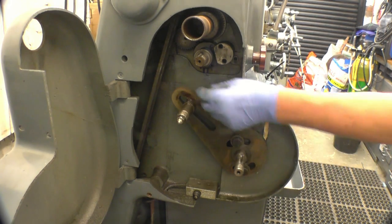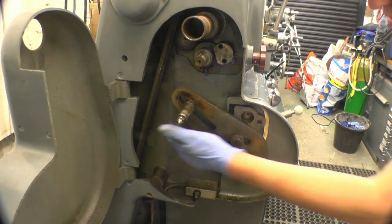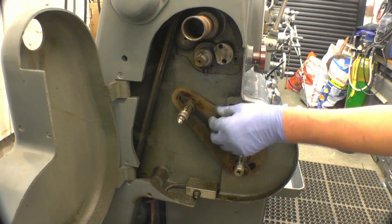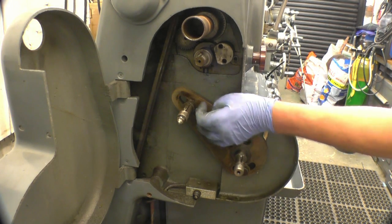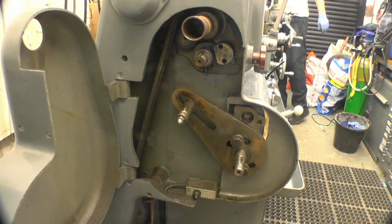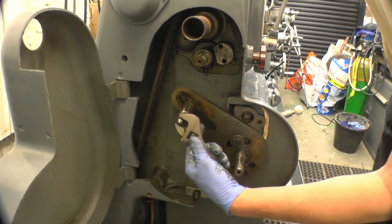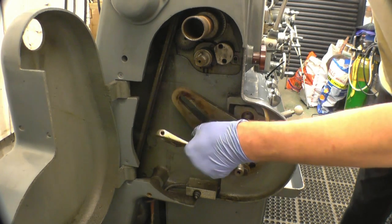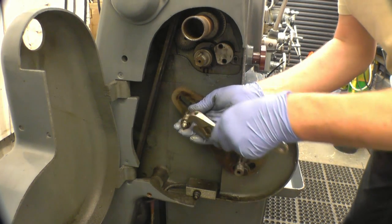This thing here — it's called a banjo. It's actually shaped like a banjo, and what it allows you to do is to move the gear up and down to move it into mesh. I assume you loosen that one there and it allows that to slide up and down that slot — which it does. That's great. Right, we'll get the gears on so we can get it set up.